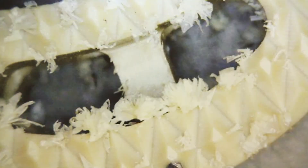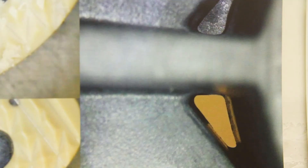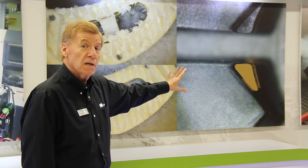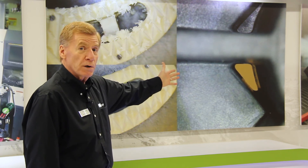In the medical arena, there are times where volumes don't justify actually molding a part. It's a high-value, low-volume part that is CNC machined, resulting in some burrs. We're able to take those burrs off and deflash the part using the dry ice process — namely the kinetic energy we talked about for removing contaminants. Also in thermosets and sometimes thermoplastics, we get flash on parts, and that kinetic energy can be used to take the flash off a variety of parts.